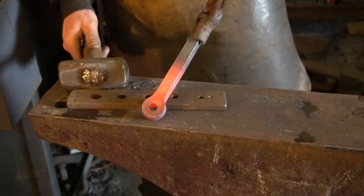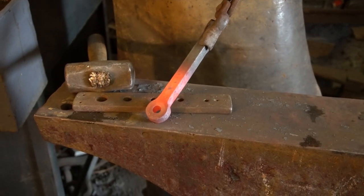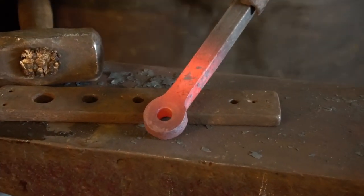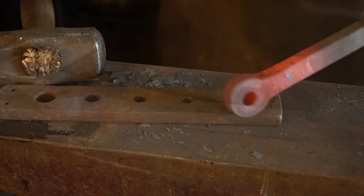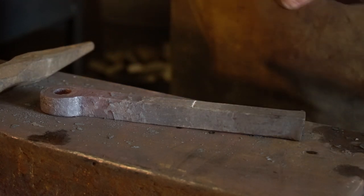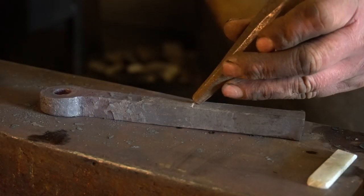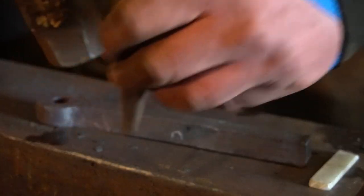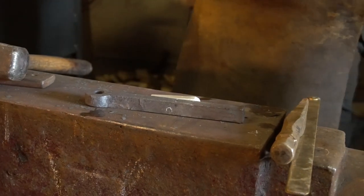Our upset, punched and drifted hole is done. Now if I was using this for making a pintle for a gate — a tie bar for a gate for instance — what I would do is forge a tenon on the end of a piece of round bar, drop it through the hole, and rivet it up on the back side, and I'd be able to hang my gate hinge from it. So I'm going to put a mark on my bar at three inches, do this on both sides, and centre punch that — nice deep centre punches so I can find them again when the bar is hot.